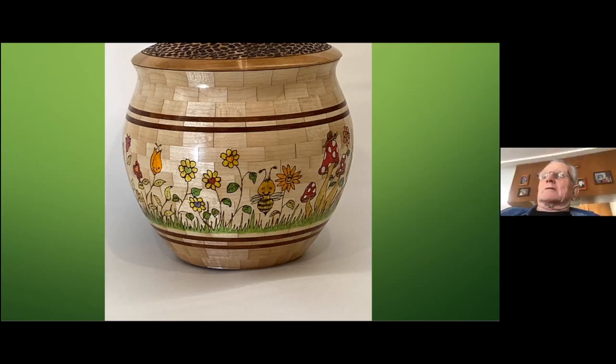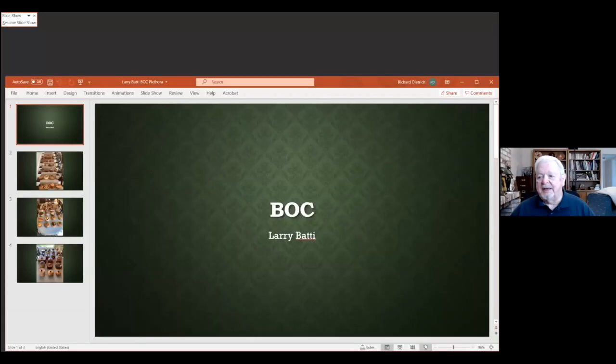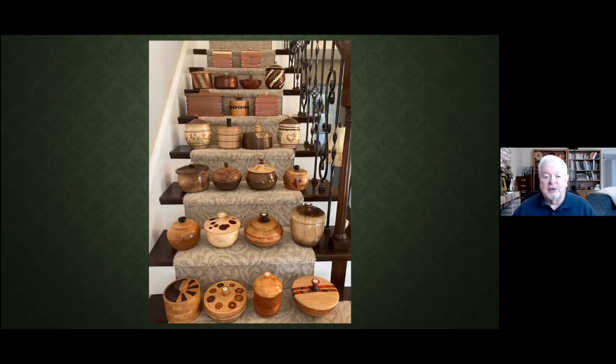Very nice. Thank you. One of the other ways to create black spots like that is to take a fine carving burr in a power carver, run it at high speed, and just force it into the wood. One of our famous instructors in that area has shown that it'll burn every time by overdoing it. Wow.